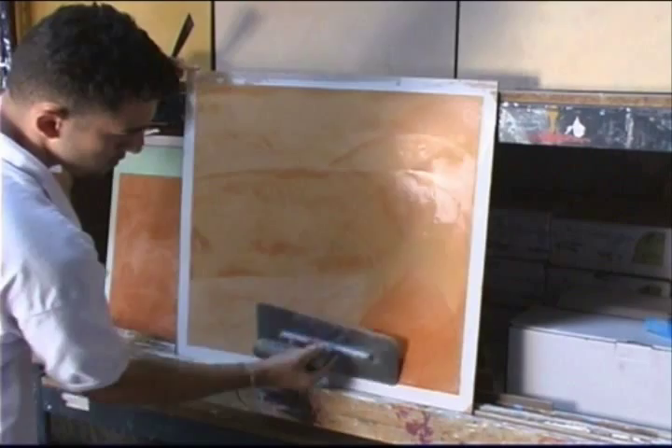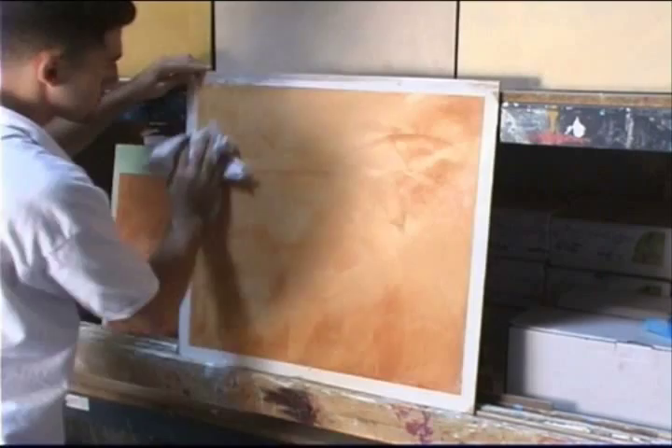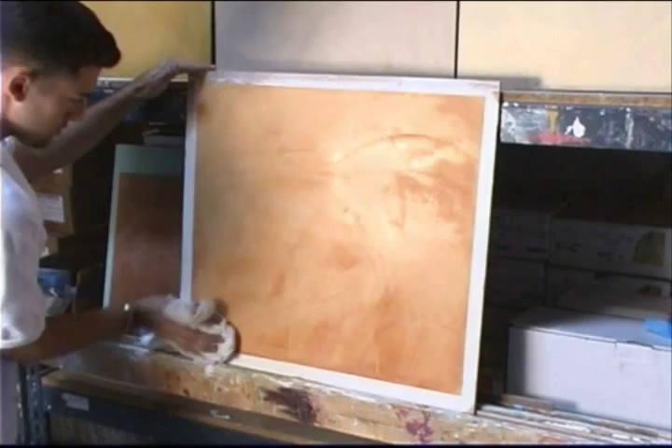Come back with a rag and wipe off the excess. Make sure your material is completely dried — if not, it gets kind of nasty looking. Make sure it's dry, then apply your impregnation paste, let it dry, and it adds a nice sheen and makes the walls water resistant. If you want to clean it — very, very nice finish.